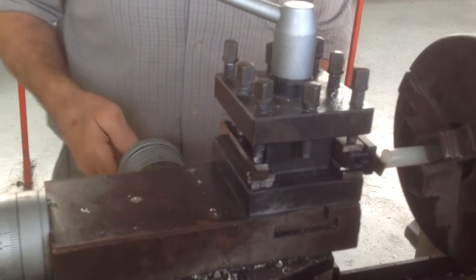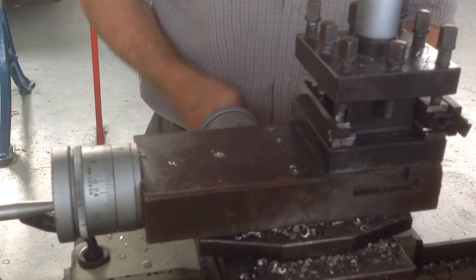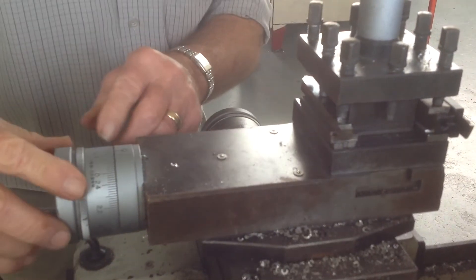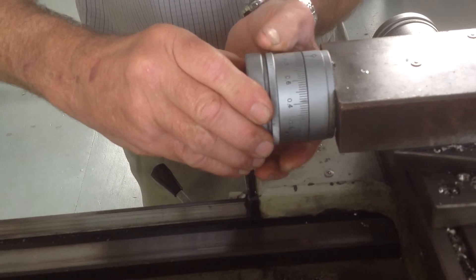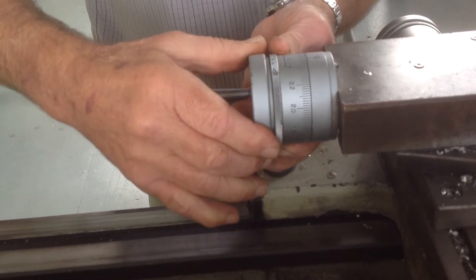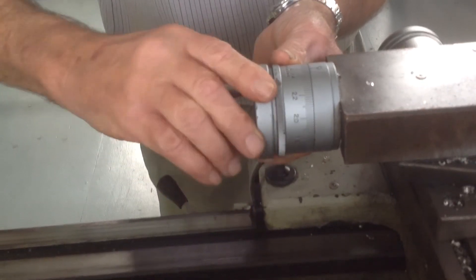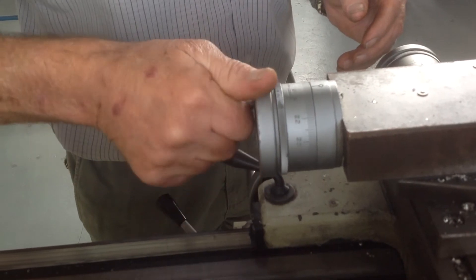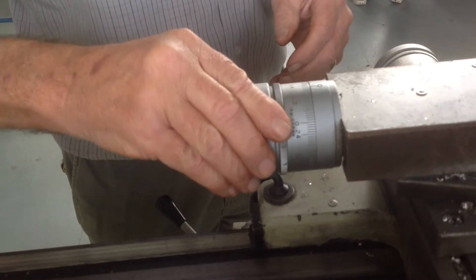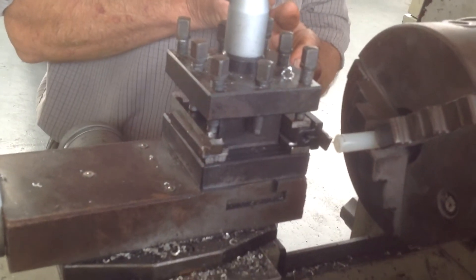Because we know it's flat, we bring this back and do the work. We set this part at the back here to zero — it turns to zero — and if I turn it one whole turn, that's two and a half millimetres, and I need to go another half a millimetre. So I've now moved this whole thing three millimetres.